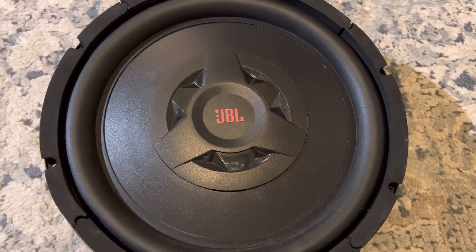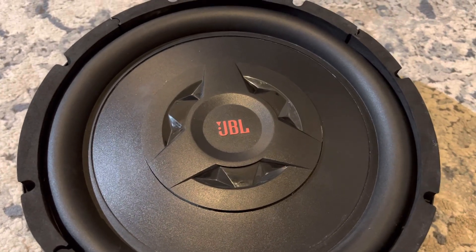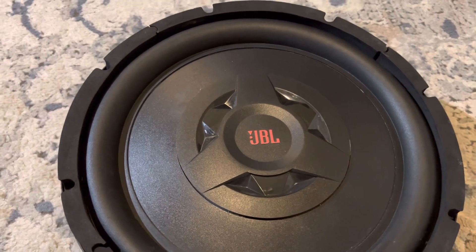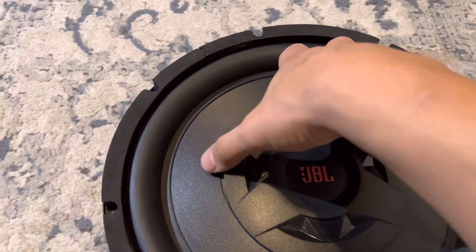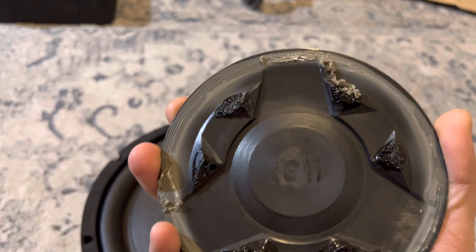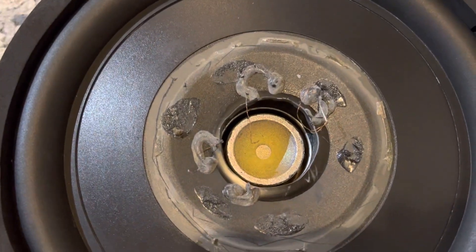The first part is to take the dust cap off, which is right in the middle. In this particular case, these are one of the easier ones. With a little bit of heat from a heat gun - without risking burning up the plastic or polypropylene on there - we just heat it up a little bit, take our plastic accessory tool, and we're easily able to remove the dust cap. They just use a rubberized adhesive, whether it's RTV, silicone, or something similar like E6000, so it doesn't take a lot to remove these dust caps.